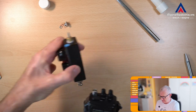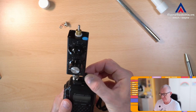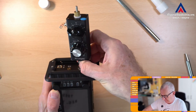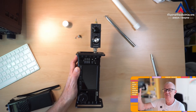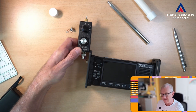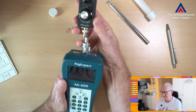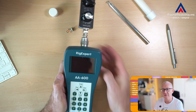Let's find out how it fits on the radio. There's enough space to reach the knobs. Let's try another one — here is my 6100. On the 6100 it maybe is better to use a 90-degree adapter. The next step is to go outside and measure the SWR on all bands using my Rig Expert antenna analyzer.